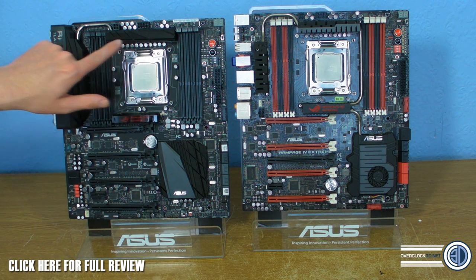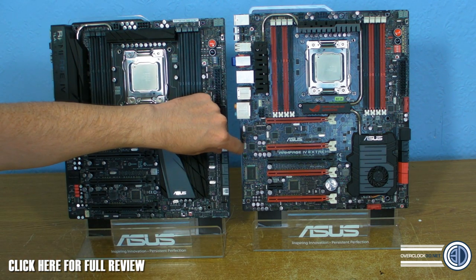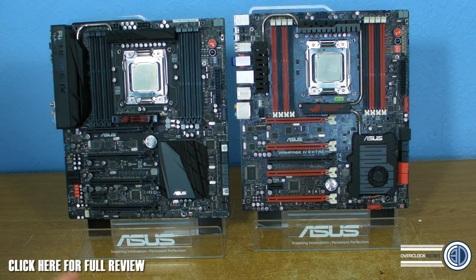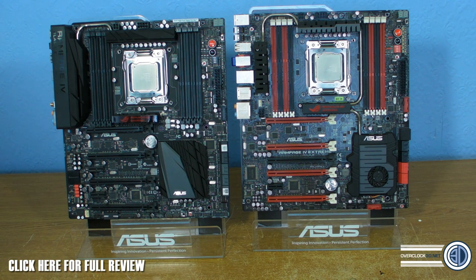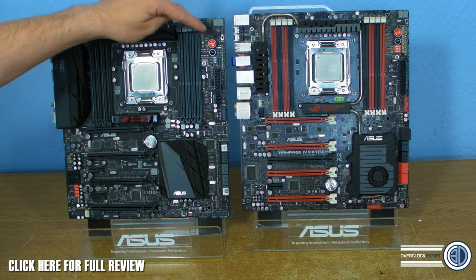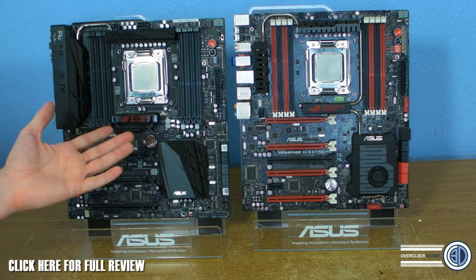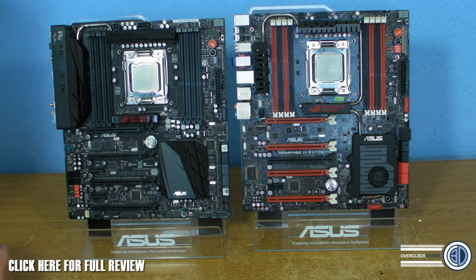The gold chokes that I showed you at the top there, they're capable of 60 amps, and they're obviously gold coated. Then you've got sub-zero sense down, where is it? Here, where you've got K-type probe digital thermometers, and they're capable of minus 200 to plus 200 degrees. There's loads of hardcore overclocking bits on this, like a slow mode, an LN2 mode. There's VGA hot wire. Something I do find quite strange is they're saying on this that there's four more fan headers, because they're everywhere.